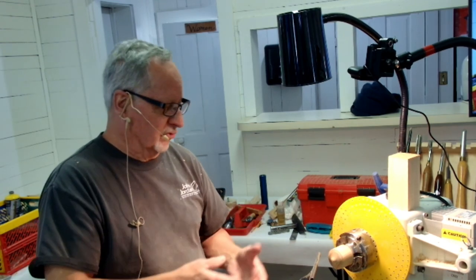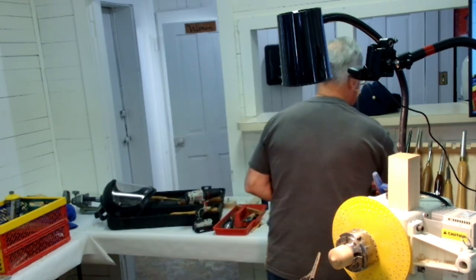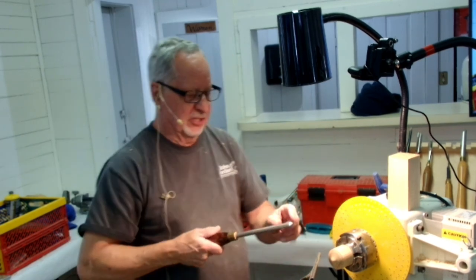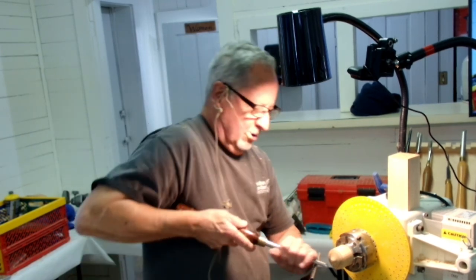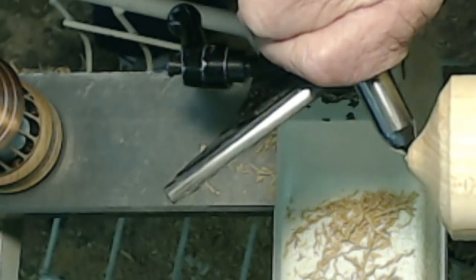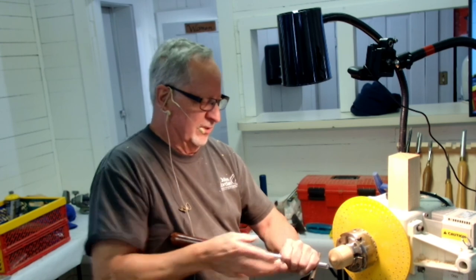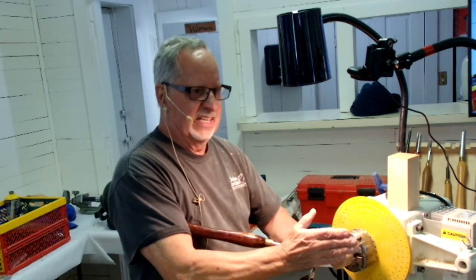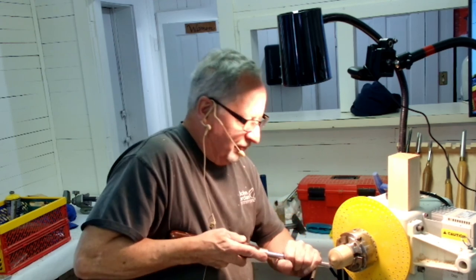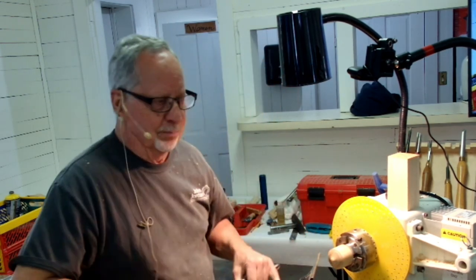Yeah, a big, thick one, because what you're doing is you got the tool down here, and you've got it underneath your armpit. Let's just pretend like that's one. Most of the time, it's a polished piece of metal. You got it down like that, and you got a pin, and you're forcing it against that pin, and you go back, forward and back. If all you do is go forward, it thins out the metal, and it breaks right there because it got too thin. So you have to go forward and then come back, and then go forward and go back. And that's a pretty cool process.